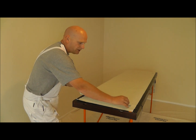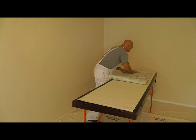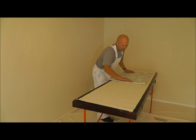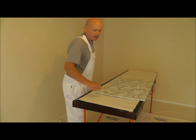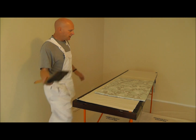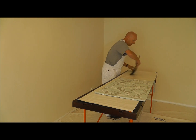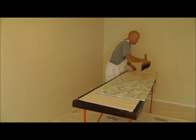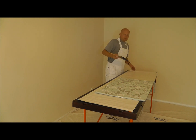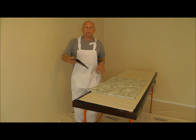So what we do is we just take our two edges like this and draw the paper up and lay it down nicely, slide it into place. We then pull the paper back over to that one edge, and be careful not to put too much paste on the brush here because we've only got a little bit to do. So again, just the centre bit, and then again, the outward criss-cross action. You're sort of holding the brush like you would a table tennis bat really, and then draw it towards you - a little bit more paste there.